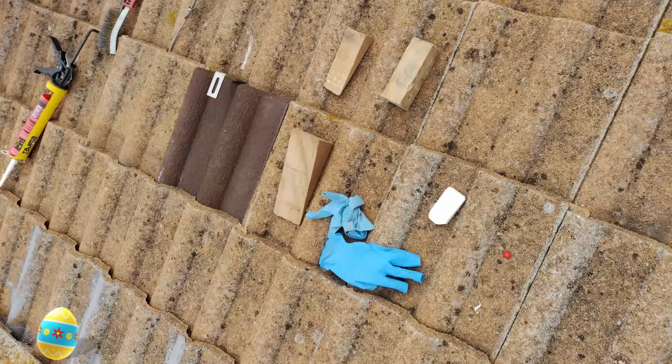I've taken the design of the brackets and asked a local company to cut the stainless steel to measure and bend the stainless steel to measure, and I made the brackets and the plates myself, even because on my roof it's not possible to drill across the roof, so I had to glue the parts on the roof. So it was a new technique that however I've seen others already use, and I used the same bonding component used by them to glue the plates on the roof. Hopefully it will last for a long time.